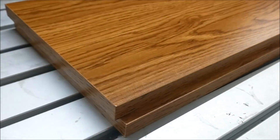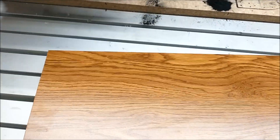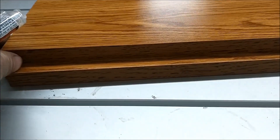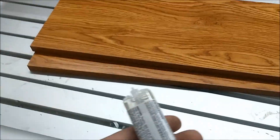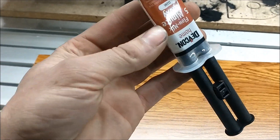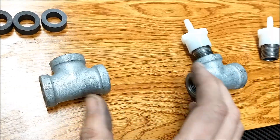I got my base for the new air bearings here and it's melamine — it's very flat, and you want that for the air bearings. I'm going to glue these two pieces together so that it becomes more rigid, and I'm going to put some drywall screws to clamp them together after I glue it so that it locks in place. I'll be using this self-mixing epoxy right here. We are building the air pressure supply — that's this piece right here.